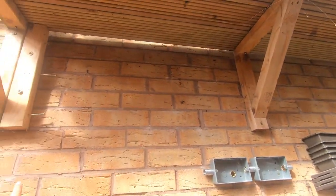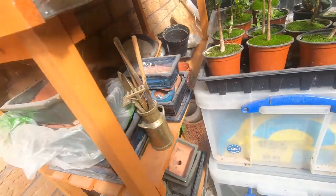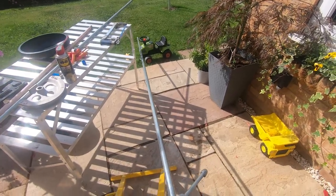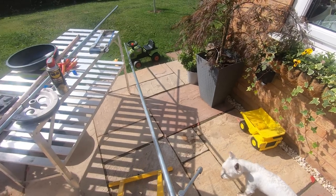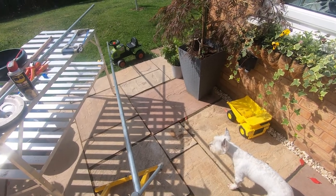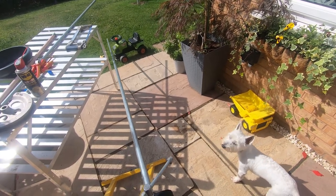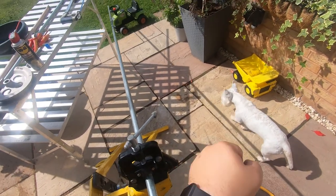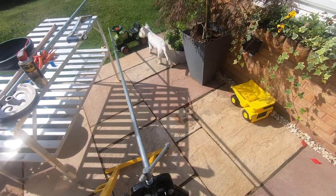And what we'll do now is we'll get a length of tube to bring it down to about here. And whatever's left over, we'll take down that side. Grab the conduit, get it a little bit better in the vise. On and off, on and off, half a turn back, half a turn back, bites its way through the conduit, does a really good job. Nice and easy, twisting and cutting back until we've got enough thread to go into the coupler.